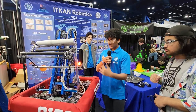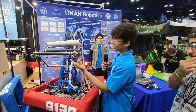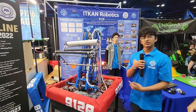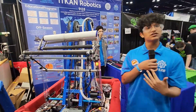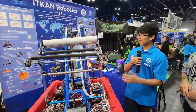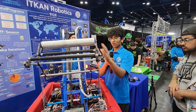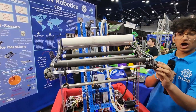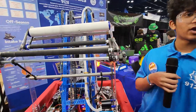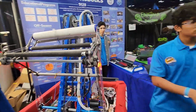After that we went with a simple design with just two rollers, which was much faster and didn't cause the robot to tip at all, but we kept seeing cubes escape from us. That led to our current iteration — a much bigger wheel at the top that allows cubes to go much faster, along with Omni wheels so that the intake could glide on the ground and we could rotate while the intake worked.